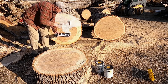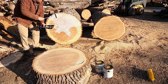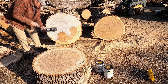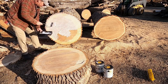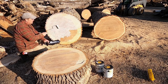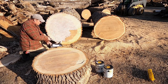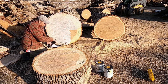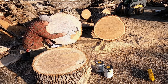Sometimes you can get a little too excited. We're just working it into every saw mark, everything — we want to coat it heavy. If you use Anchor Seal or another method, leave a comment below with what you like to do. It's an awesome community where we all learn from each other. With temperatures right now in the mid-40s dropping to the 30s at night, this is probably going to take two days to really dry. Next chance of precipitation is two days from now, so we'll be just fine, and we're not going to freeze overnight — excellent timing.